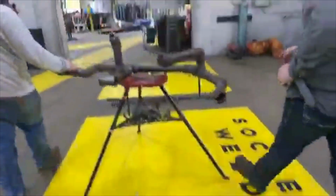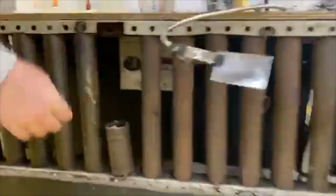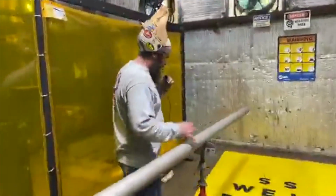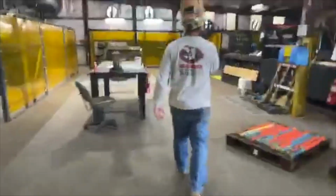Socket welds. Every week, every student has to cycle through these real-world practicals. We got 1-inch butt welds. Tube wall. You got to weld this thing with a mirror. There's our cameraman. Stainless steel purge. We let our guys come out here and work with some schedule 10, and we'll let them do an argon purge with the solar flux. Let's walk over here. We'll show you some more practicals we have.